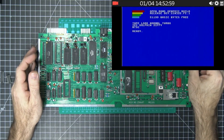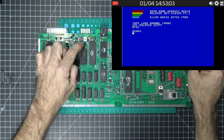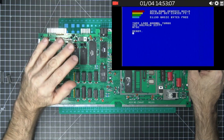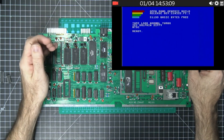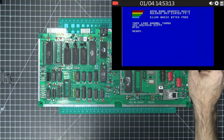As you can see, the font looks different. The reason I'm switching both of these is because the switcher works by switching images 8K at a time. So using the switchless device, we can only put eight character ROMs on here.